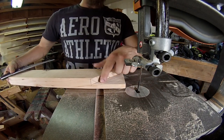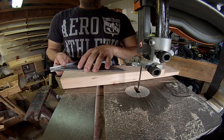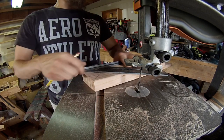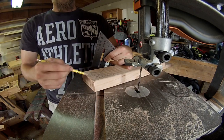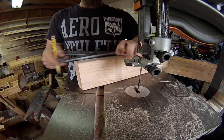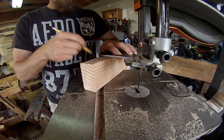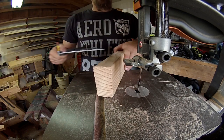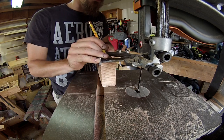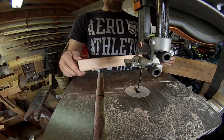To begin with, we're going to cut out this little notched corner for the half lap joint using the bandsaw. All you have to do is mark out your corner area using a speed square — line it up against the corner and draw out your line where the miter will be. You'll cut out this little section, then go over to your edge, make sure you've got three and a half inches, draw another line down as your depth stop. This is going to be mainly freehand, so if you aren't comfortable doing freehand, don't do it. The half lap part is going to be three-quarters of an inch, and a speed square is extremely handy for this because it's got all the little notches.